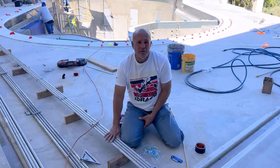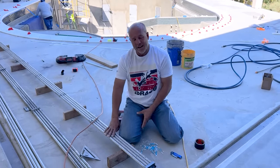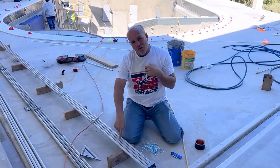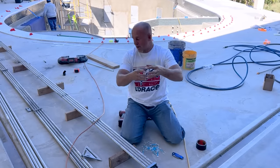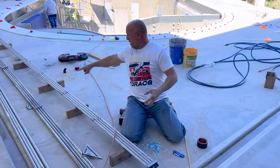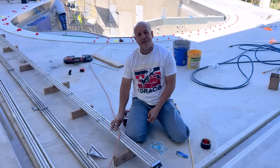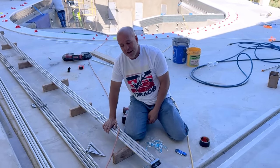I can't have it corrode. I'm using a salt system in the pool for the purification. So it's stainless steel, and to make sure I have backup to this waterproofing, once I install this stainless steel inside the 4-inch stainless steel large tube with these machine parts we made all the way down it, I'm going to pour a 2-part liquid rubber and fill the entire void, all 27 feet up. That's so that if there were ever a problem with these pipes corroding through, which isn't going to happen with this stainless steel, it's the best you're going to get.